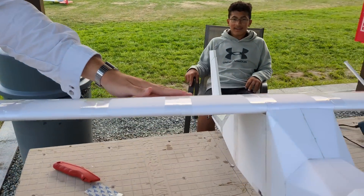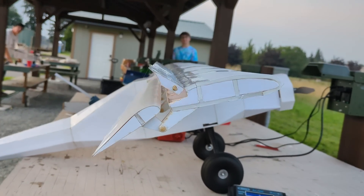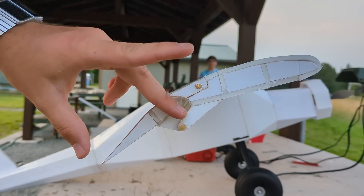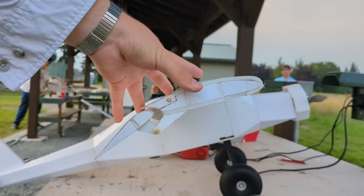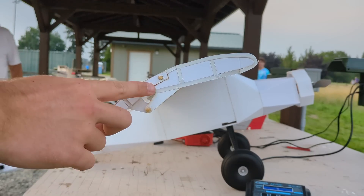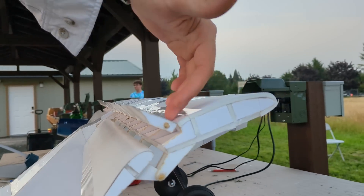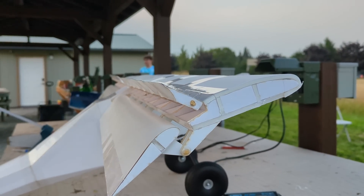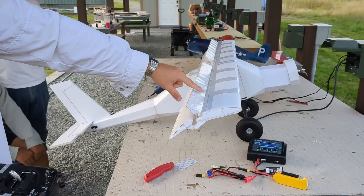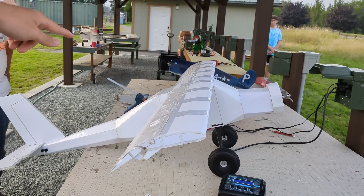There are two main types of control surface on this aircraft: spoilers and flaps. They do opposite things. What the flaps do is as they go down, they basically start acting as a second wing at a higher angle of attack and produce more lift. This slot here lets air in from the bottom over the top to energize the flaps. The spoilers, when they go up, stop air from traveling smoothly over the top of the wing. Most of the lift is produced by the air going over the top, so this interruption kills all the lift on that wing — and that's your aileron. So to roll, I just kill the lift on one wing or the other.